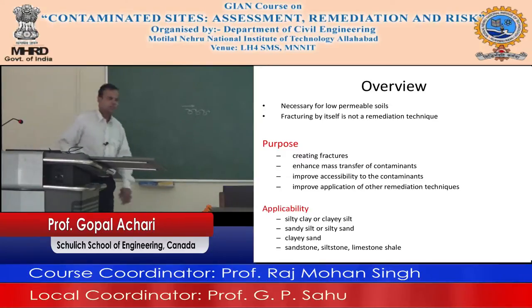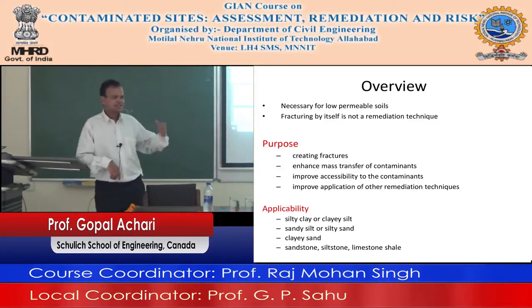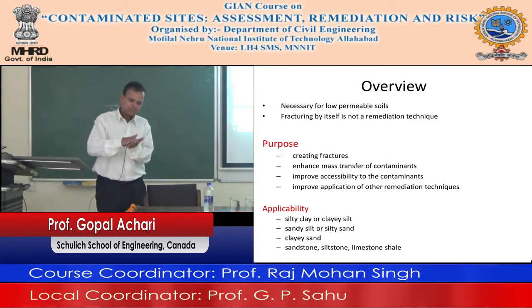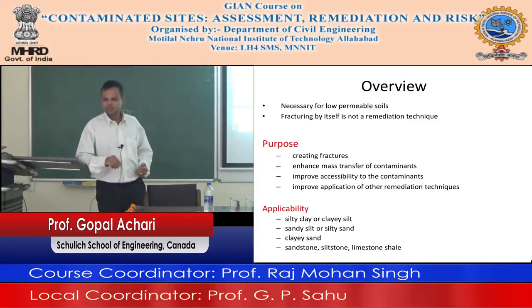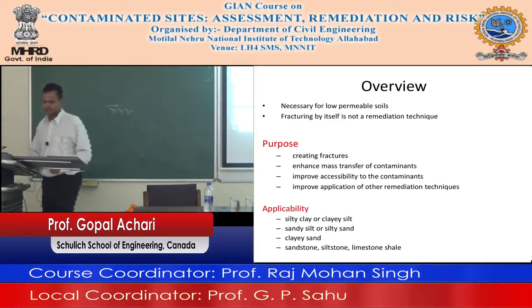So what we do, in our case, is we want accessibility to the contaminant, right? If you have clay material, you can use the same concept. You can fracture it, open it up, and then once the pores are open, you can do bioremediation. You can send nutrients down that pipe. You can put air down that pipe. You can even extract if you wish to, if there is any vapor to be extracted. You have improved the accessibility of the site by fracking open.